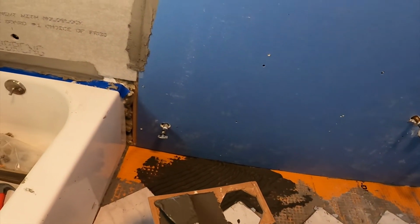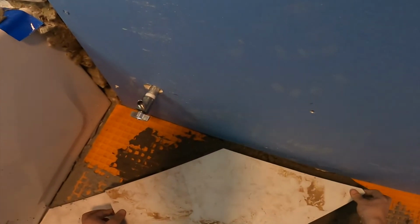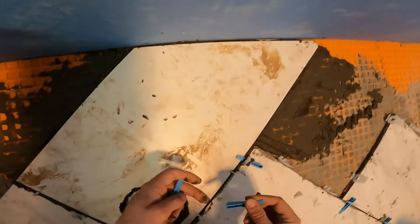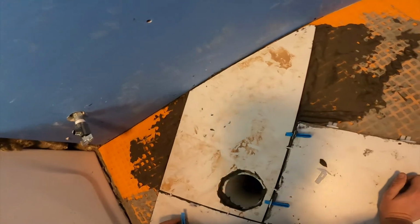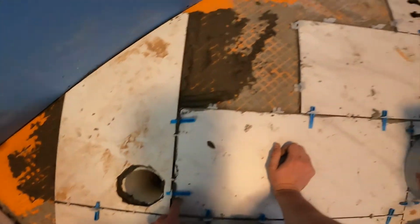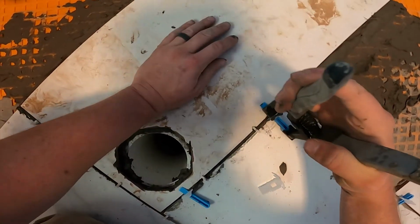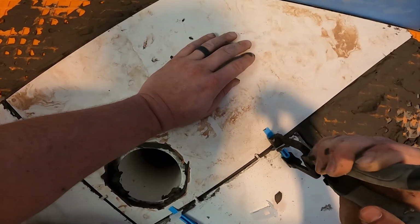I swear, the stuff that you can do with these tiles with a little bit of patience can look absolutely amazing. You can see that patience pay off right here when this one tile, the special tile for the toilet, lines up exactly where it needs to. Putting in a couple wedges and securing it down with a little, I'm just going to call it a clamper thing. I don't really know what it is. But this hand tool right here to clamp your wedges into place against the break-off tabs goes on super smooth, holds everything real tight and flush, and it's going to come out amazing.